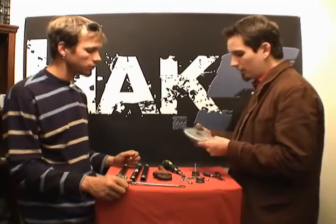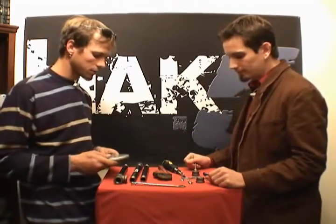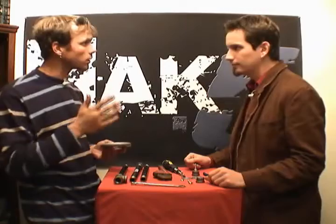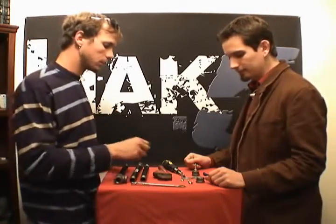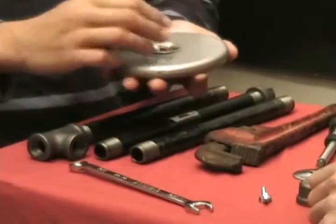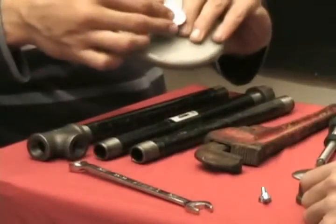Okay, start off with the counterweight. Here's the 2.5 pound weight. This is going to be the bottom of our Steadicam, and that's actually what's going to act to steady it, counteract any kind of swinging motion. So we take our weight, 1 machine bolt, and 1 flange washer. Washer down, flange bolt through. Flange washer on the other side.